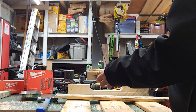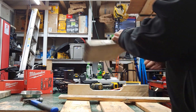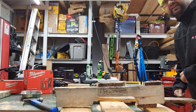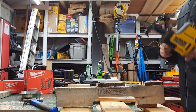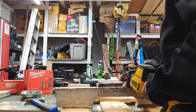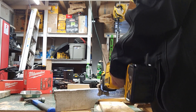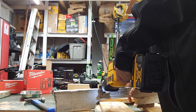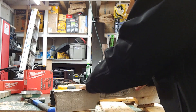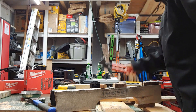Because it's a stronger wood, I would feel better about yanking it out with the hammer's brute force method. Another thing I like to do to get nails out is take my trusty reciprocating saw and cut right about where that nail is — just enough to weaken it so the piece falls off. Now this thing doesn't have a leg to stand on; you can move it around and pop it off pretty easily. I've got my Crescent nail puller here — I think it'll do a dandy job.